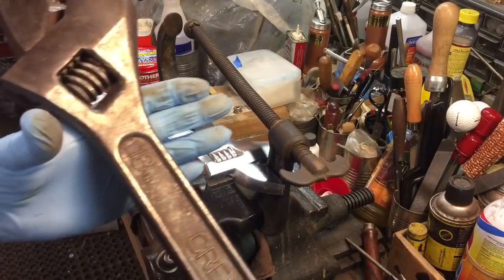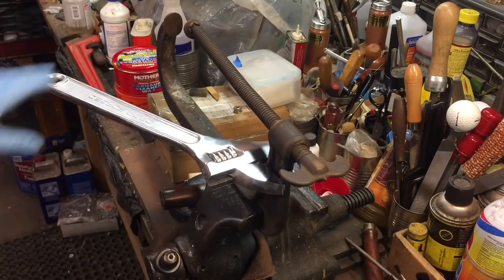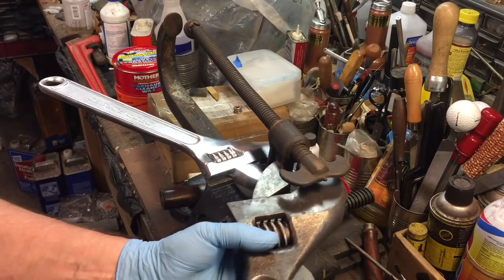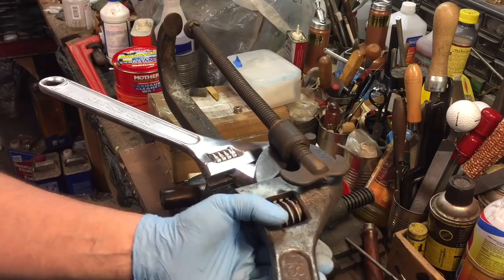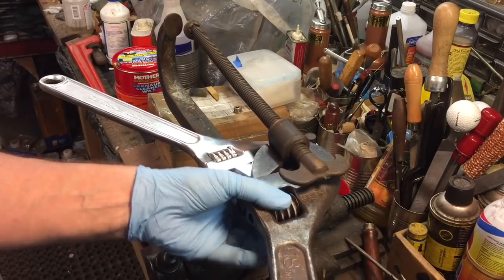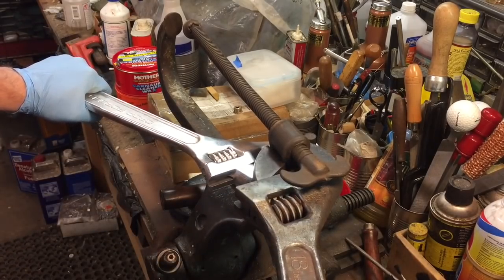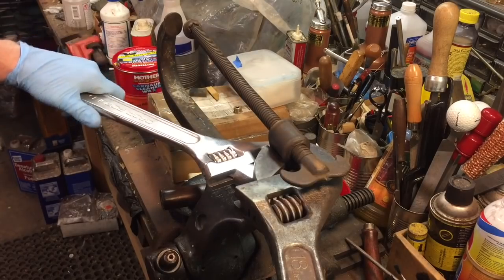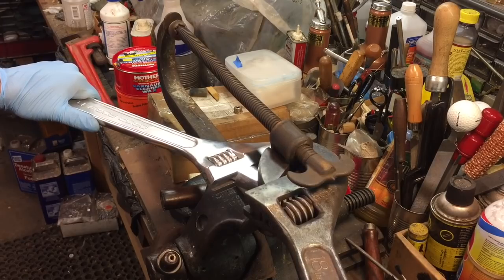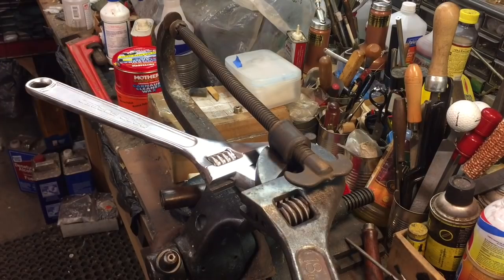Here's where the big wrenches come in handy. We have a nice 18-inch crescent wrench and another wrench — we're going to couple two of them on here. We have it in the vise. We'll put one wrench on the bottom and the other on top, tighten up, and with two hands twist it. We're going to watch the top as we twist it, and hopefully it'll bend. You can see it bending — we go a little bit past and bend it nice and easy. And you can see we straightened that right out.